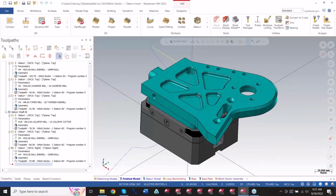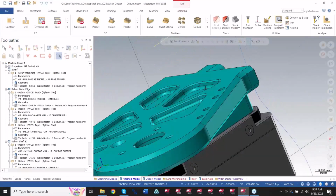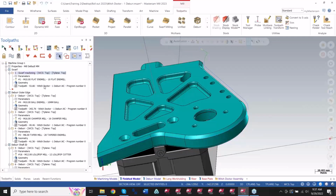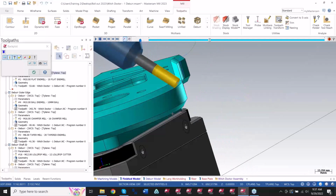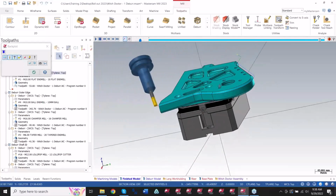So yeah, without further ado, let's go ahead and get into this multi-axis rollout. The first thing I'm going to talk about here is the deburr toolpath. We had a little bit of a ramping up with this toolpath because in the past, if we had a feature like so, where you wanted to get this chamfer cut out, a real deep chamfer, and in one pass as well, we weren't able to use deburr to do that. We would have to use something like swarf machining to grab the geometry. You would grab the upper rail, the lower rail, all the surfaces. You could add tilt lines, all that nasty stuff that you have to deal with, right? Just to get this motion out and about using the flat of the tool.